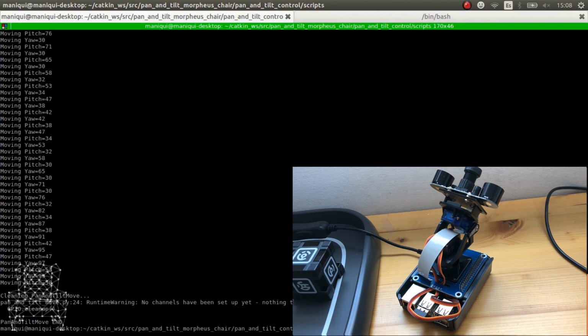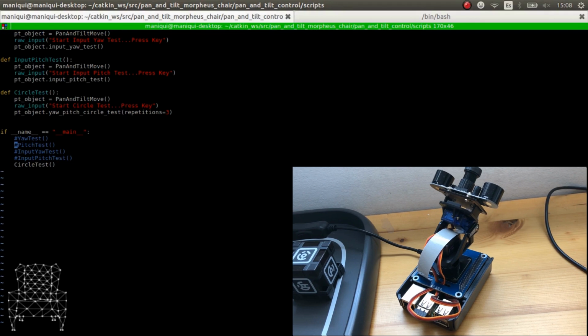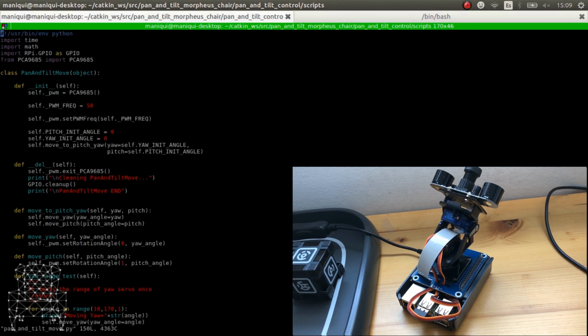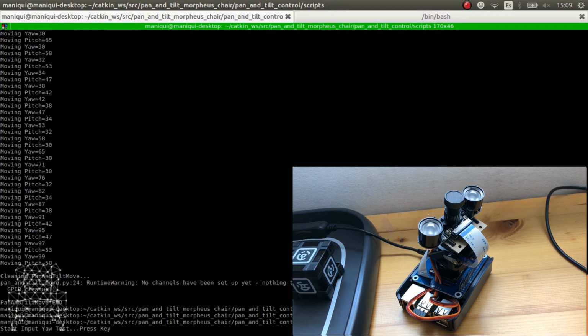So what if we want to do other stuff? For example, let's have a look at the pan and tilt script. I want to do, for example, the input pitch or the yaw first. Let's put the yaw and let's comment this. Right, and quit. And let's execute this. Oops, sorry. Let's execute it. It sets up every time to the 0, 0 position. As you can see, it's at the maximum, and that's why it's buzzing so much.